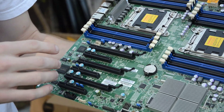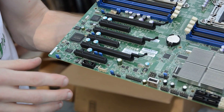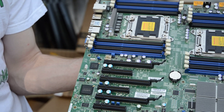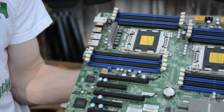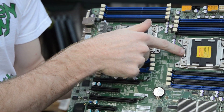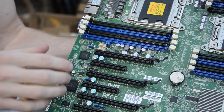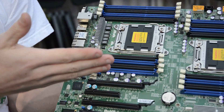As you can probably tell, this is very professionally oriented — there's no USB 3 or overclocking or any of that fun stuff, but that's all right. The PCIe arrangement is very simple — what you see is what you get: x16, x16, x16, all PCIe 3.0 full lanes, and then three x8 slots also PCIe 3.0. We can have so many lanes without bridge chips or NF200s because each CPU can deliver 40 PCIe 3.0 lanes. You can actually trace the lanes going all over the place — tons of bandwidth for Tesla GPU compute or high-bandwidth RAID cards.